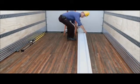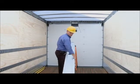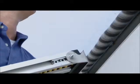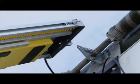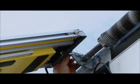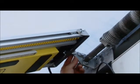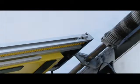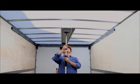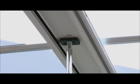Pick up the front of the CommandLIFT track assembly and fasten the adjustable mounting bracket to the balancer center bracket that you installed earlier. Place the 5/16 inch nut and bolt through the 2 pieces and finger tighten the nut. All nuts in this area will be tightened later. Using jack stands or another safe method, lift the CommandLIFT track up to the ceiling or roof bows.